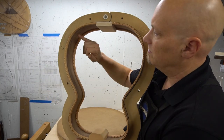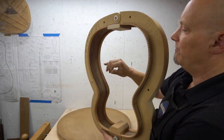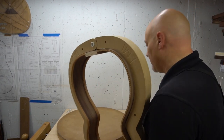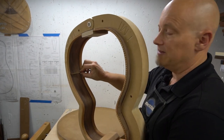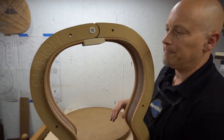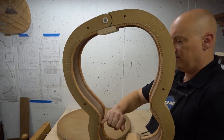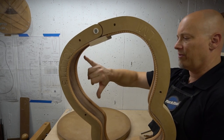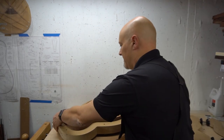Side struts are braces that go along the sides, reaching from one kerfing to the next. They span that gap and their whole purpose is to stop, intercept, and interrupt any cracks that are going to happen. You'll see them typically on the flats here, maybe one in the upper bout, maybe one or three here — we just want to space them out so they're able to intercept those cracks.